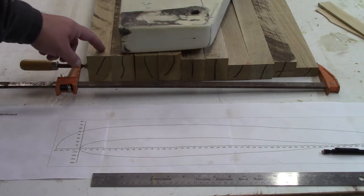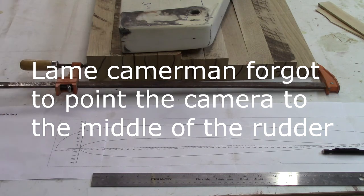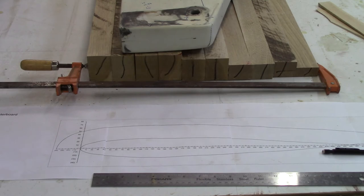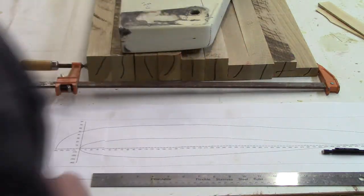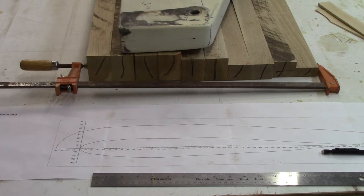This gives you an idea of the additional almost three inches that we're adding to the front of this rudder. The add is all below this section — this part up here will all end up being cut away, and there'll be a transition below the bracket coming down at an angle to match the bottom of the boat. All of this area down here will be the additional width we're adding. I'll be drawing a center line in the middle of each one of these blanks on both ends.